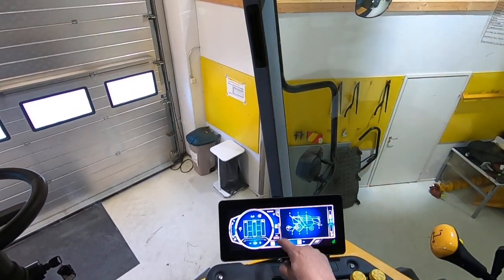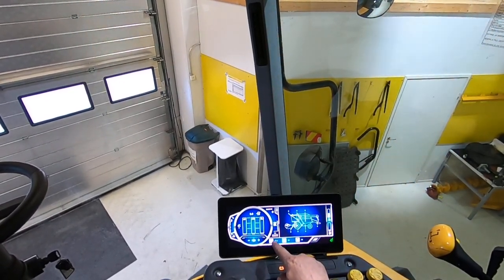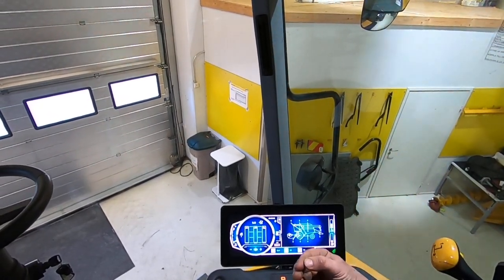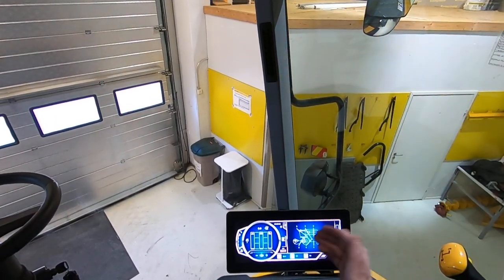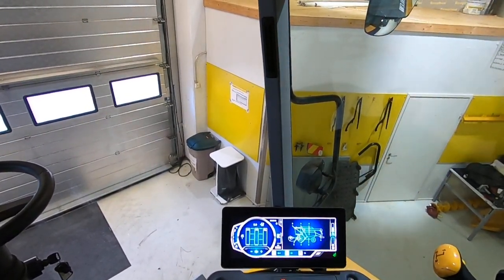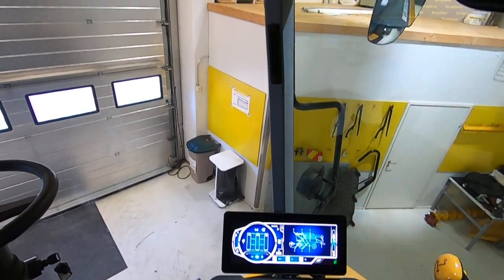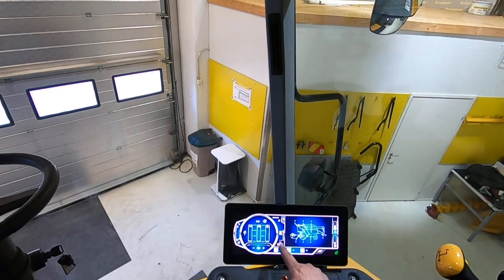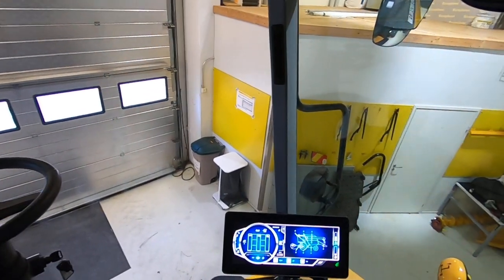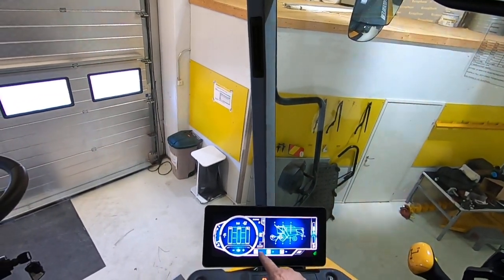Where your header is at, it shows in percentages. Here it is measuring hectares. Also, it's just the driven distance and the width of the header, so it's no yield measuring or something like that. But in case you want to follow up and calculate and see what is going on, remember always to put that half header when you are doing the last bit of the field, and in case it is left like that, it's not taking the full cutting head.